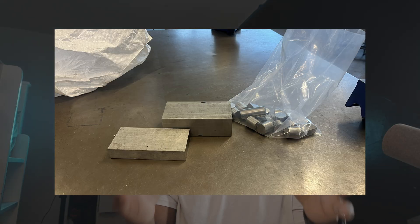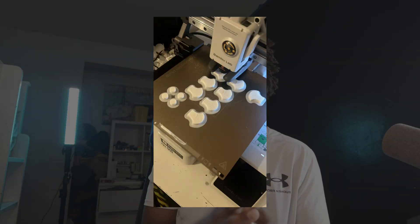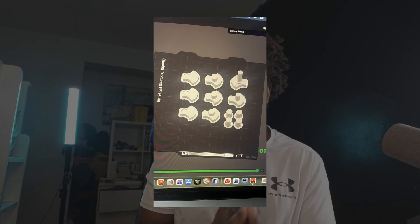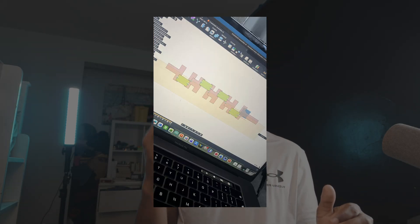I was kind of panicking because the metal was expensive. We'd gotten everything ordered in 304 stainless steel — actual blocks for the engine block and crankcase, all of it. There was basically no going back, especially since I finish school in a few months. So what I had to do was print out all of these components and all of the pins, and test it all out to make sure the alignment would be perfect. Because it's the crankshaft — if the alignment's off, it's going to cause a lot of jamming and be dysfunctional. It took me quite a bit. I decided to print at the best quality I could, basically how it would actually function, excluding the layer lines.